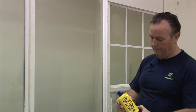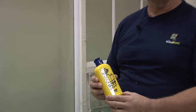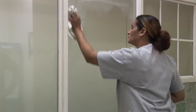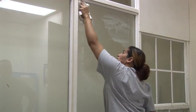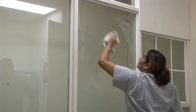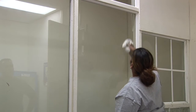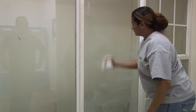One important thing to add: only use the degreaser that we supply with the Crystal Bond kits. It's not just a degreaser — it's actually what they call an anti-shine compound. It gives a very light etching to the glass surface, which enables Crystal Bond to bond better to the glass surface. When the degreaser is dried, we use some clean terry cloths or microfiber cloths and buff all that degreaser off the surface of the glass. We prefer this over using water because we want to try and keep the edges of the glass dry, and let those seals around the edges get very dry before we do the coating. You can see it leaves the glass quite shiny and clean.